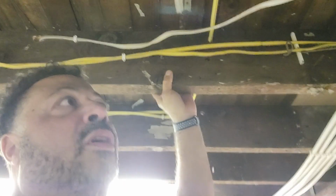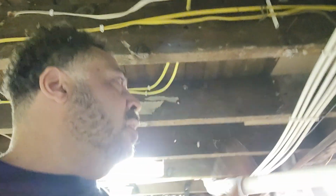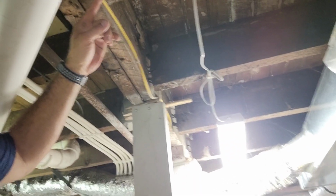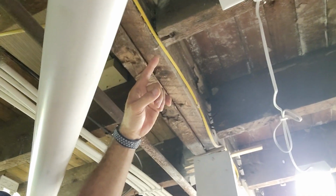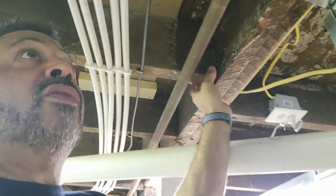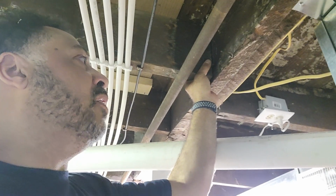So there's some soft spots in the floor upstairs. And so you're looking at 110-year-old lumber, which is strong lumber. It's not an issue with that. But here's the problem, look at this. You see that? The nails have softened up underneath of it. And clearly you can see they've done a lot of work down in here. And what they should have done is getting some joist hangers and putting in here to tighten it up. Okay? To make sure that they don't loosen up.